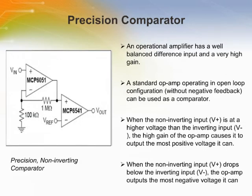The most frequent application for comparators is the comparison between a voltage and a stable reference. Because comparators have only two output states, their outputs are near zero or near the supply voltage. Bipolar rail-to-rail comparators have a common emitter output that produces a small voltage drop between the output and each rail.